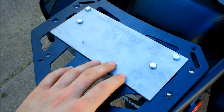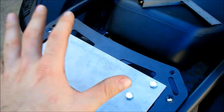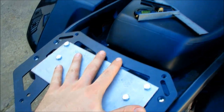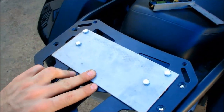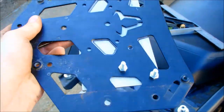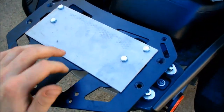I've got the plate cut, the holes drilled, and I've just got some temporary hardware in here. It's very important to use metric fasteners on a metric motorcycle because your tool kit does not have standard wrenches in it. So if I use these quarter-twenties, which are obviously just temporary, I couldn't use my tool kit on them because my tool kit is metric for my metric motorcycle.